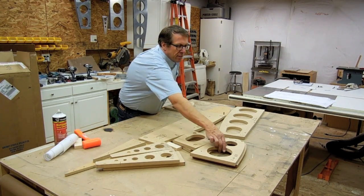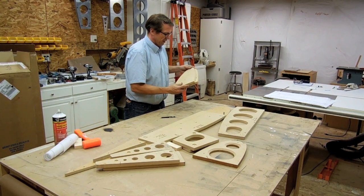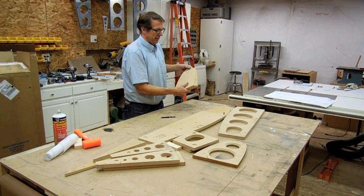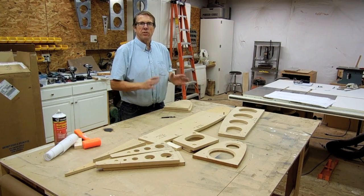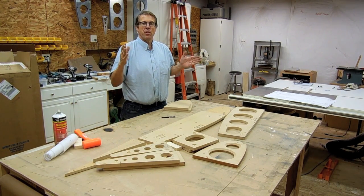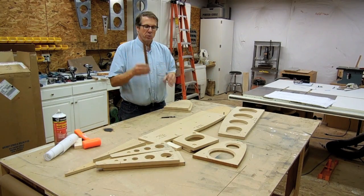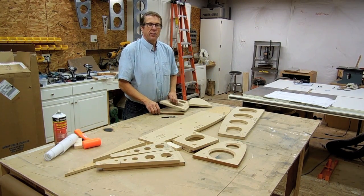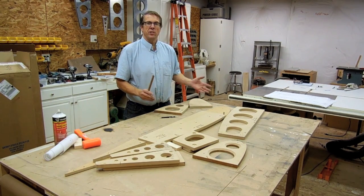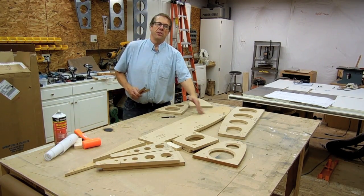Once I had that piece cut out, I then had the cutting jig. As you can see, lining up the jig pin holes, I have about a 9/16ths edge all the way around that rib, with the cutouts shown as they are on the plans. Because on the plans, some nose ribs are full length and, because of the cap strips on the spar, some will be an eighth inch shorter and some a quarter inch shorter. So I didn't have to make three different jigs — I used pieces of hardwood attached on the back, cut the master cutting jig down a quarter of an inch, and attached a piece of quarter-inch and a piece of eighth-inch hardwood strips on the end. I did this for both the nose rib and the center rib.